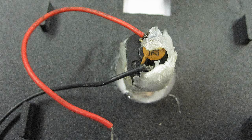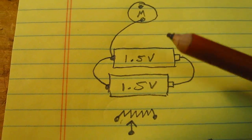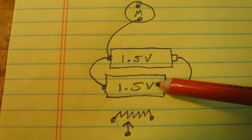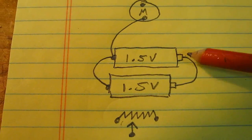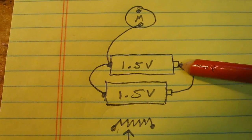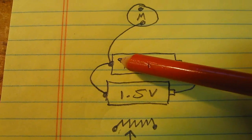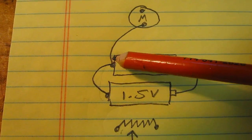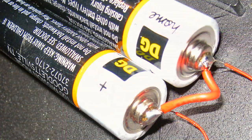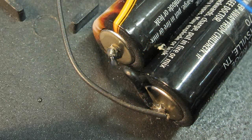First, I'll show you the schematic and what we're going to do. The first thing you want to do is take your two batteries and connect them together in parallel — that means they're both hooked together. So you solder the pluses together and the minuses together. After you do that, you run one minus wire to one side of the motor. These two batteries will last a long time. Of course, you can use a battery box that holds two cells in parallel, or put in rechargeable batteries.